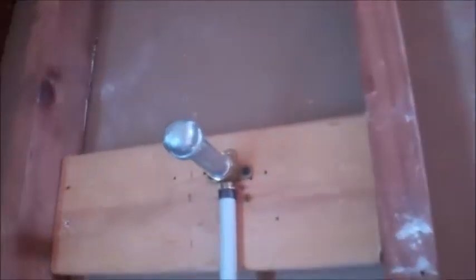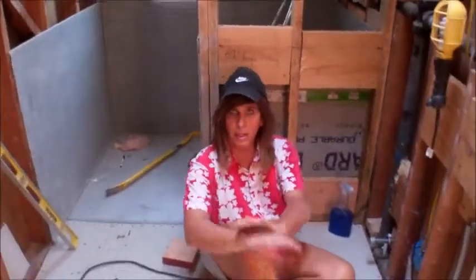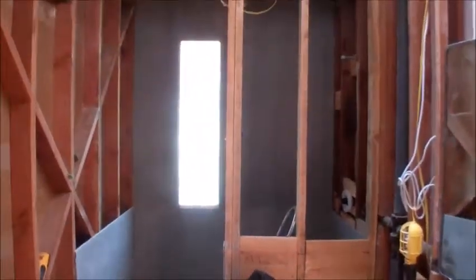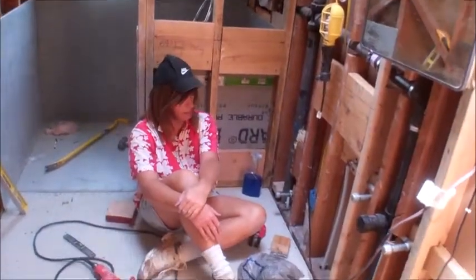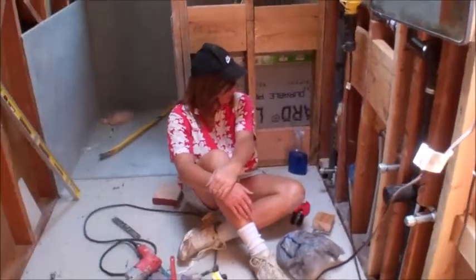On the shower there's a stub out there too. Just put some more on the wall here. This wall around the window — it's nice and tight. I've siliconed around the window so we'll be able to put the tile flush with that, be perfect. Set it level up and down so all the walls are perfectly flush, so everything fits well. Now I'm going to slowly turn the water on and test to make sure we don't have a leak.